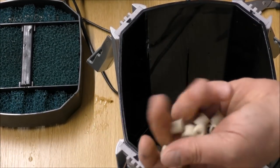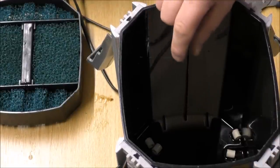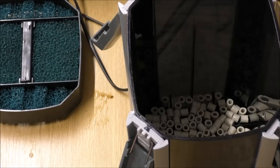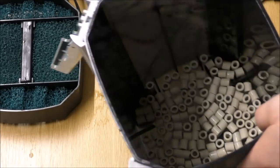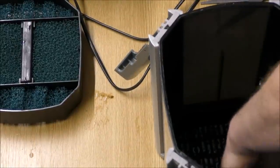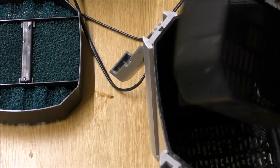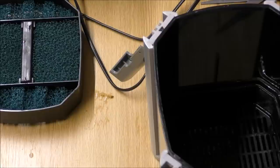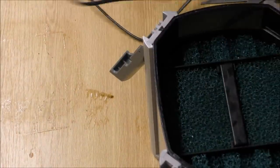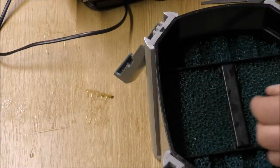Those are just little hard tubes made of a ceramic material. Now because those fins in the bottom aren't very tall, we're just going to get one layer in the bottom. That should give us our correct height. I'll just put all these back together and test the height. Good — top goes on, no problem.